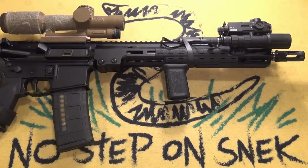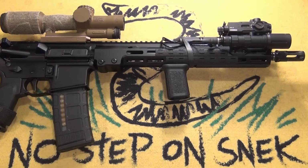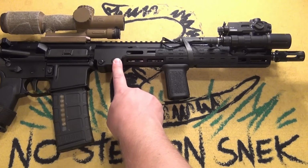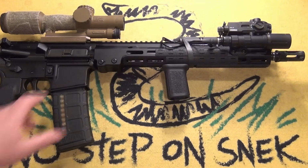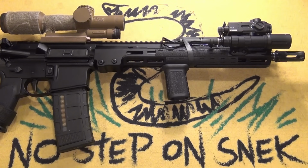And the last thing in the good category, I like the receiver cut, and it's a small attention to detail that they also put throughout the rifle. Like not coating the extractor. These are captive. There's a detent in here, which is what that tiny hole is. So when you do finally break these loose, good luck. When you take these out, they're captive. So they'll pull out and stop. It's very well made. And you have the receiver cut, so you don't have to worry about how it indexes. Very nice touches, and Geissele's known for that, and I really do appreciate that they do those things.